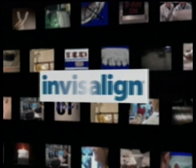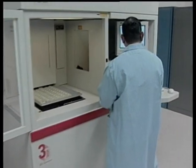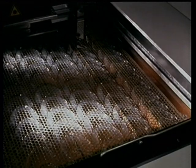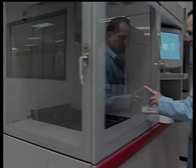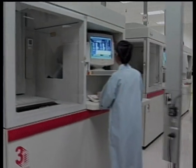When approved, the plan is used to construct a series of dental models formed out of photosensitive thermoplastic. This process has been specifically adapted for Align Technology. Each of these machines performs stereolithography to take the digital information and create an exact physical replica. A laser beam solidifies liquid resin layer by layer to produce a series of models replicating each stage of treatment for each patient. Align Technology is the first company in the world to use stereolithography in a high-volume manufacturing environment.